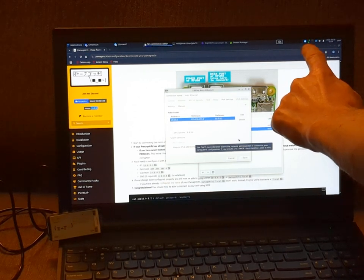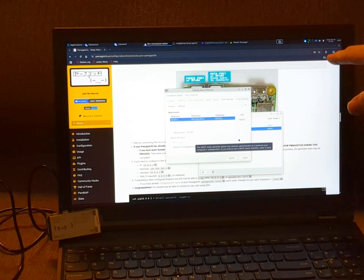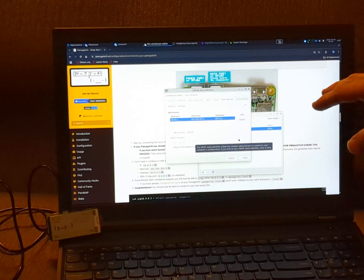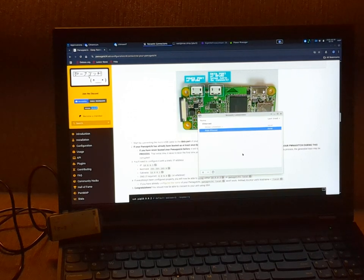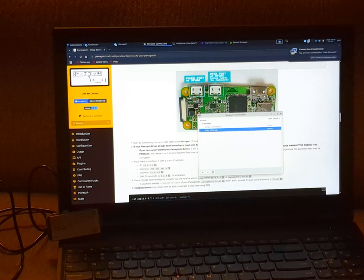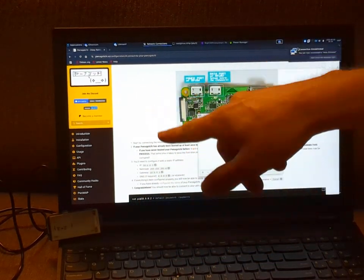As you note at the top, it's still trying to connect to that automatic connection — that's a big problem. A lot of Pwnagotchi users are not reading the directions, so they may miss that you actually have to set these IP addresses. So we'll go ahead and hit save, and when we do that — there it is — it automatically successfully connected. Now we have a direct network connection to our Pwnagotchi device.